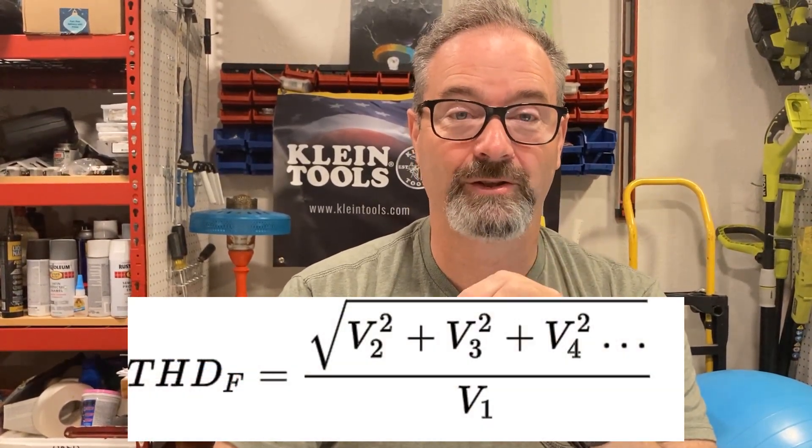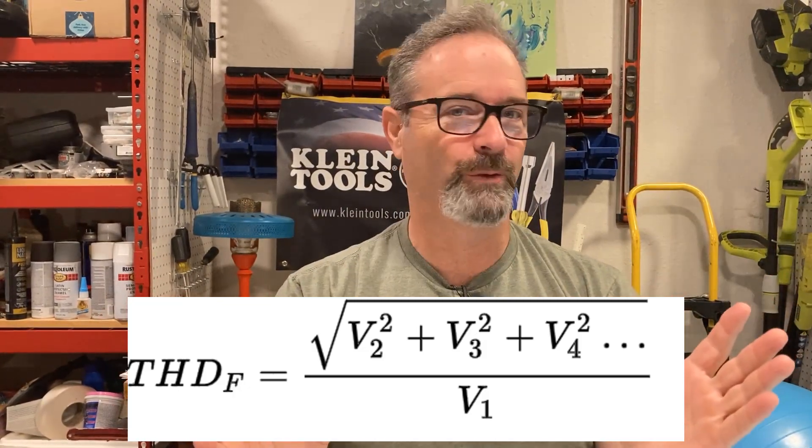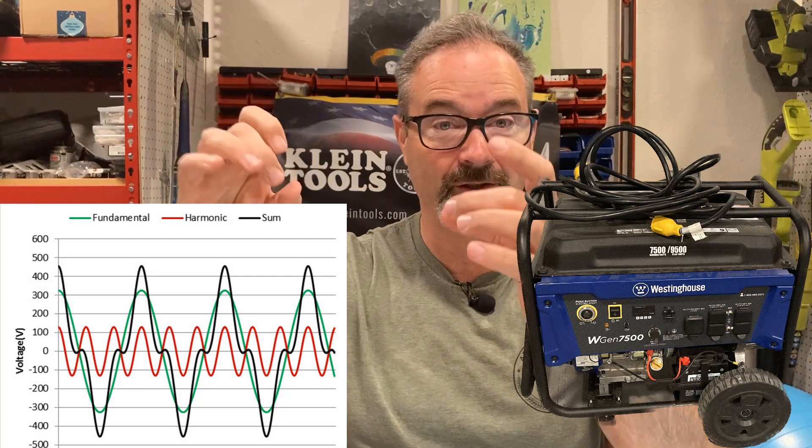My wife looks at me — I don't know if she crossed her arms but I imagine she did — and she goes, 'Is that normal?' Tough moment for the man ego. I said no. So the next day after I turned that off and restored the power — we have solar panels — you guys have heard of THD, total harmonic distortion. This is a great example to explain it better than I could have ever read. Here is the problem: I tested my generator just by turning off the main, but the solar sensors are attached to the feeders going into the main, so utility power was technically still on.